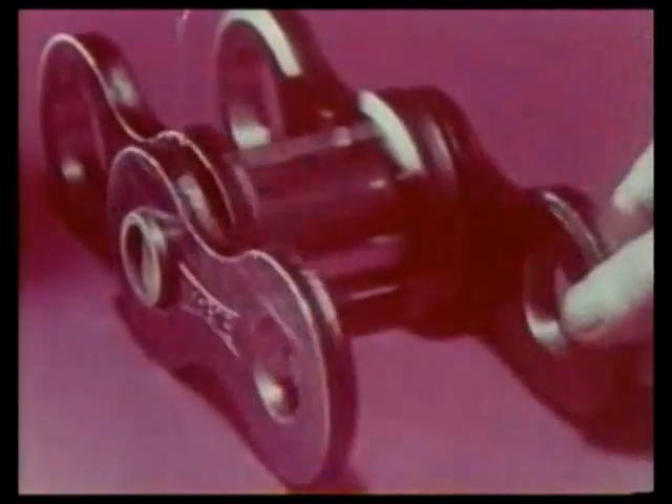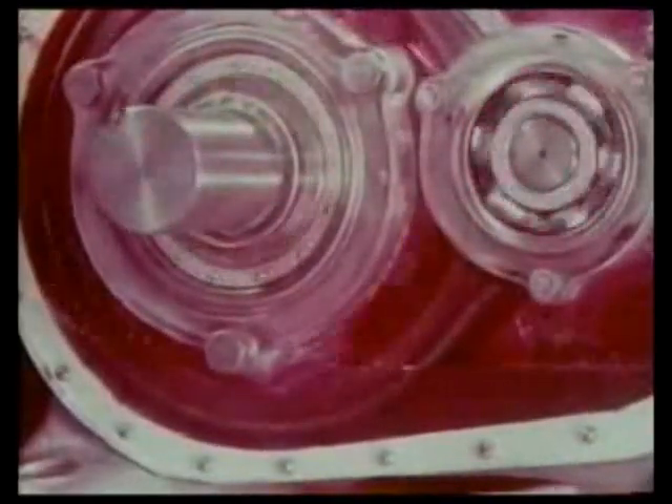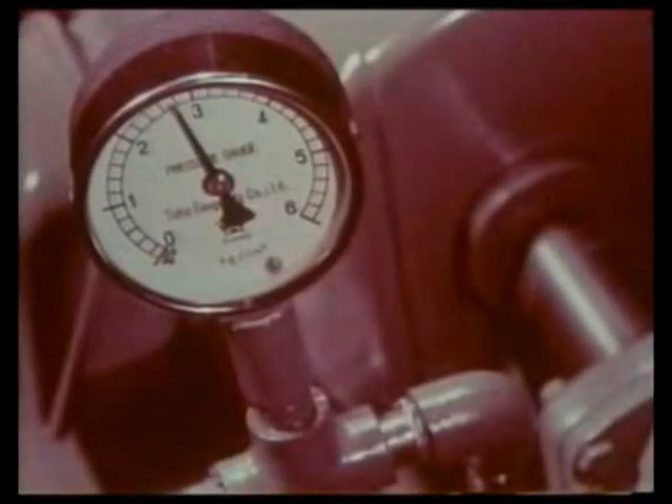The system of lubrication requires special designing. The durability of the chain depends on lubrication. Wear is accelerated if lubrication is unsatisfactory. To ensure long life of the chain, lubrication methods must match the various speeds of revolution. Needless to say, the higher the speed, the more oil is needed.